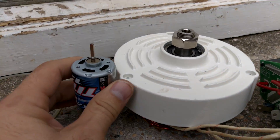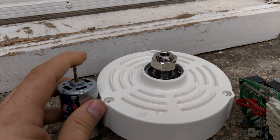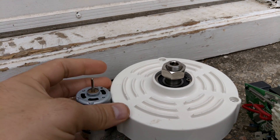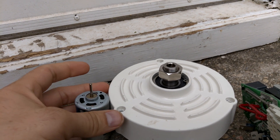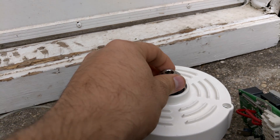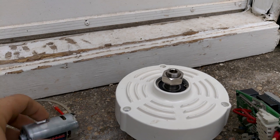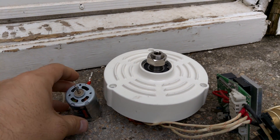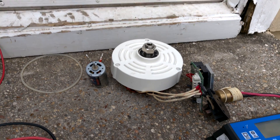So, either something in parallel, like this, where there's a belt going between the two, or a chain drive, different cogs, different gears, to try to change the gearing on the engine to the gearing on the generator, to try to find the optimal RPMs for both of them and try to get the most power out of the setup.